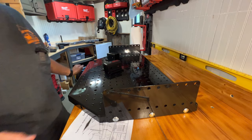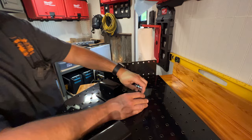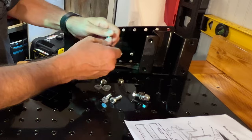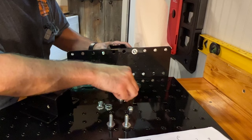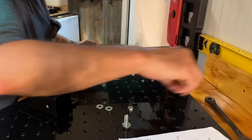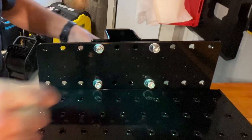I'm going to guess on placement — short ones up top, somewhere in the middle for pre-assembly. These are half inch but a 13 millimeter will also fit. The opening is going to face down. I'll loosen these first, put a washer on one side, and start the nuts. I'm also trying not to scratch the paint off the metal because that's going to open it up to rust faster — this is just plain old regular steel so it will rust. I forgot one washer here — putting it on now.